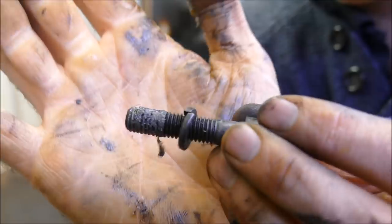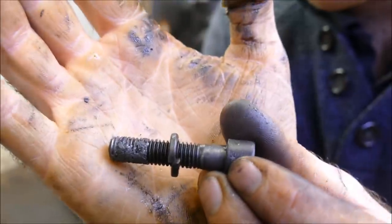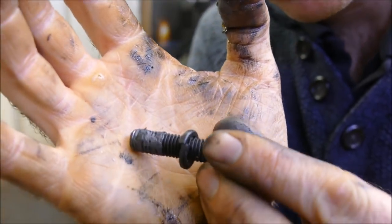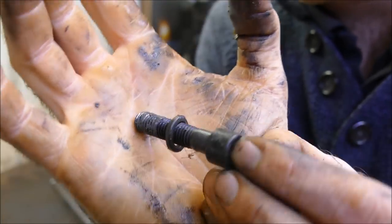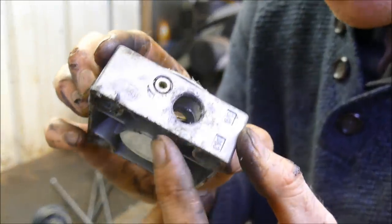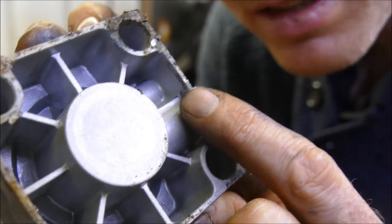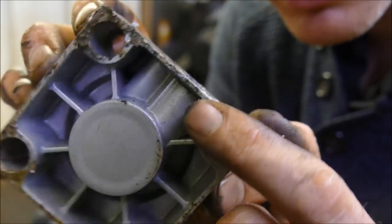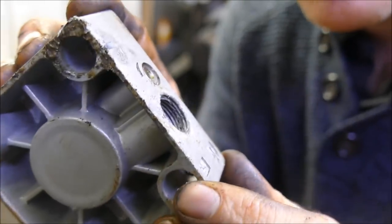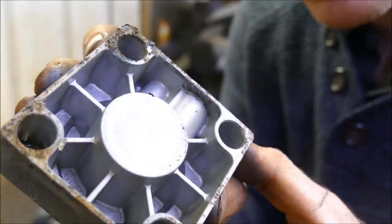So, I think having that floating joint will absorb some of that shock, and certainly replacing the rubber cushion with an air cushion will also help better as well. Now, there's another problem that I've found with this, and that is the aluminium has cracked just along there where the threaded parts are. So I did notice that a bit was leaking out in the event of it breaking apart. But that crack across there, I think, is a combination of something else.